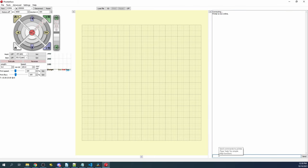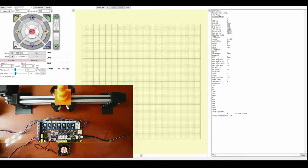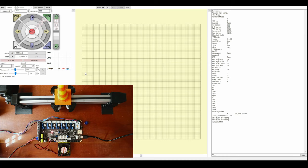I'm going to check the stepper status by running G-code M122 — it says it's okay, so we're good. Next I'm going to move the stepper 10 millimeters — clicking over here, and as you can see the fan went on, so we're good there. The next thing is to home the axis, so I'll click on the home icon. It did sensorless homing fine. Now I'll move it to center and click motors off — and in five seconds the fan stopped. That worked as well.